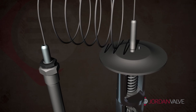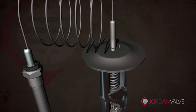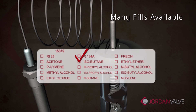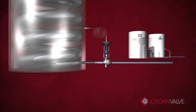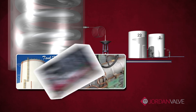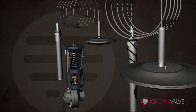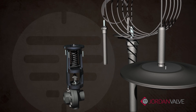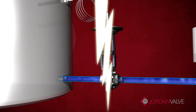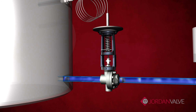The thermal system on each Mark 80 is built to order and permanently sealed. Depending on the temperature set point, various fills are used to achieve the desired results, whether the application is tank heating, steam tracing, or cooling. If temperature requirements change, system replacement is simple — you just remove four screws and replace with a new system. The Mark 80 offers the added benefit of a fully mechanical temperature control solution that will continue to function even during a power loss.